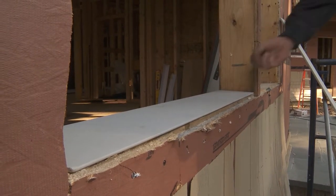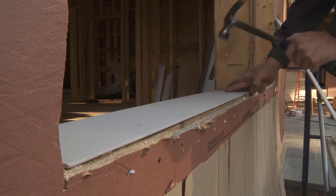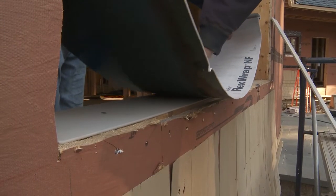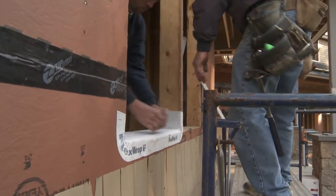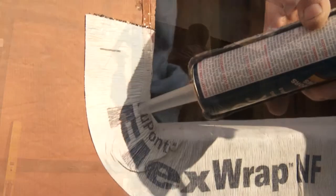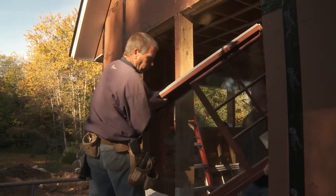The rough sill can have a half-by-six clapboard installed to establish pitch to the exterior. Making an effective sill pan is easily done using products such as Flex Wrap from DuPont over the half-by-six clapboard. Go around the three sides of the opening with a bead of caulking that the backside of the weather fin will bed into. Be sure to continue the caulk joint around the lower corners, but do not go across the sill — this will allow any moisture or water to escape if necessary.